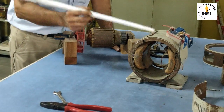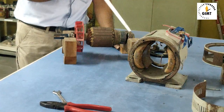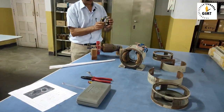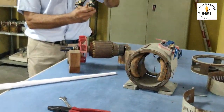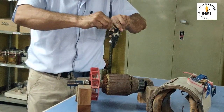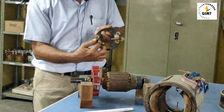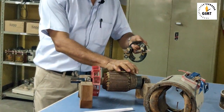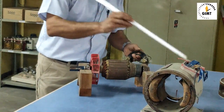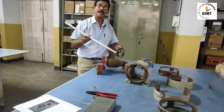So these are the main parts: stator, and rotor — which has armature and commutator. Over the commutator there will be a brush. This is the brush holder, this is the carbon brush, and this is the pigtail connected with the brushes. The brush spring rests over the brush and gives pressure on it. These two brushes rest over the commutator. As we know, if you give supply to the field coil and supply to the armature coil, both will interact and it will rotate.